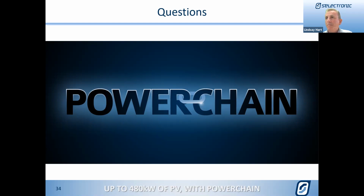Coming back to the limit of 5, it's all about how fast we can get through and talk to all of those inverters. The more inverters out, because there's the time to go and read them and get the data back, we want to make sure we make accurate and timely decisions. So the limit of 5 is really about the data rate that is provided from the Fronius and the ABB units. So that's where the limit comes from.